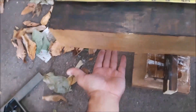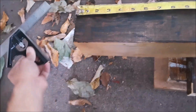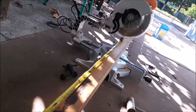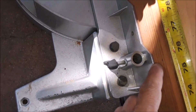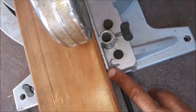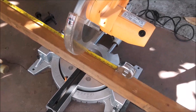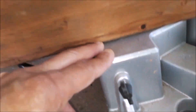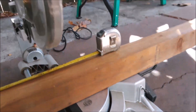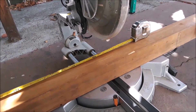Then I picked which side would lay better on the bed of the saw — this side or the bottom side. This bottom side lays the best. Since it's square on this side, I was able to pick this side against the back of the sliding chop saw. That will help make it a perpendicular square cut. It's not going to come out perfect, but you have to try your best anyway. It's flat here and flat here. I'm just going to chop this up.